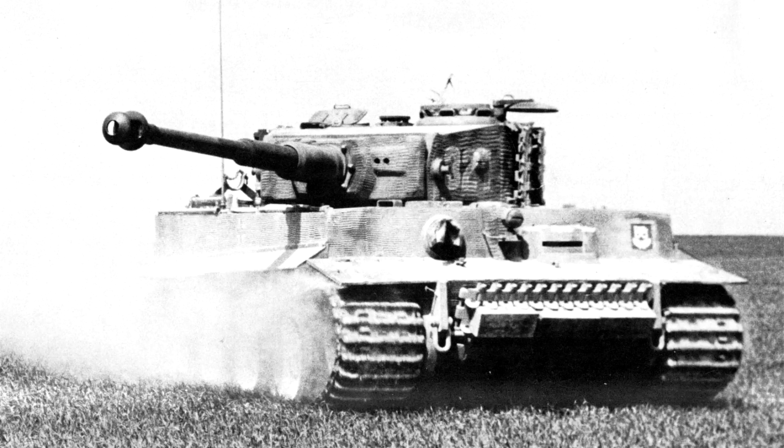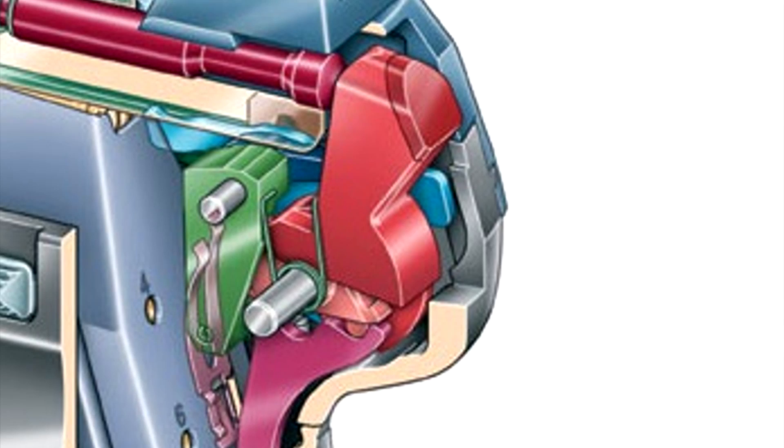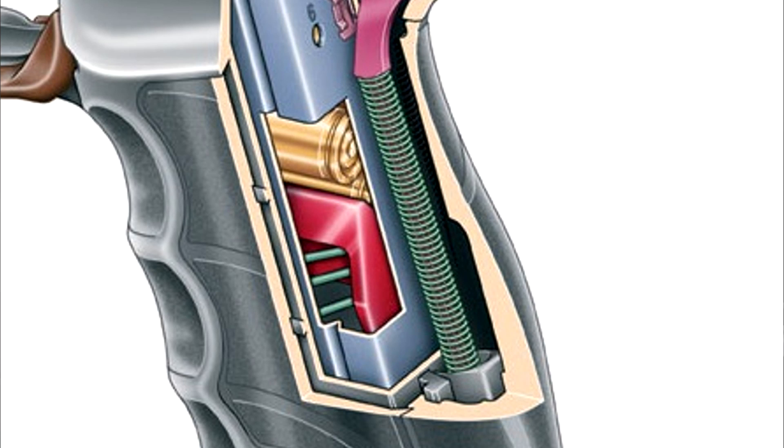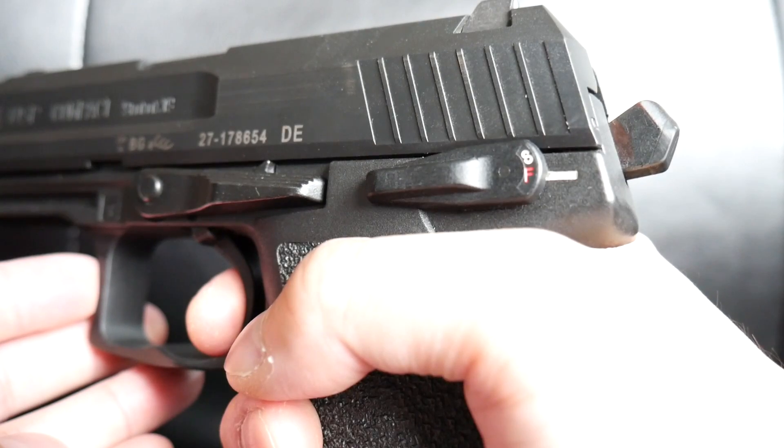As with anything German, it wouldn't be HK if not a little bit over-engineered. Basically, the LEM trigger works by having the external hammer separated from the hammer spring by a cocking piece. When the slide is cycled, the hammer spring will be compressed, but the hammer is free to fall to the forward resting position because the energy of the spring is held by the internal cocking piece. However, once the trigger is squeezed, the hammer will pull back until it hits the wall of this cocking piece. From there, the trigger feels like breaking the sear of any single action semi-auto. When the slide cycles, all you need to do is reset that trigger. But unlike double action only guns, you don't have to let that hammer fall all the way to that forward neutral position — and obviously this depends on what LEM trigger setup you have — which is why the rate of fire can be a lot faster.